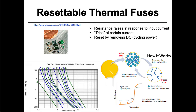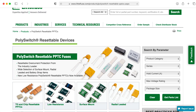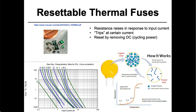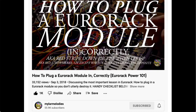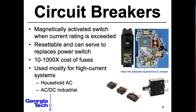A particularly wonderful kind of fuse is the positive temperature coefficient fuse, also called a poly fuse. The great thing about these is that once they trip, you don't have to replace them — remove the power and they reset themselves. These are popular for Eurorack synthesizer modules, especially because the Eurorack power connector is not polarized, so people tend to plug in their power backwards. Unfortunately, poly fuses are restricted to relatively low power systems, so they won't work for an entire building or heavy industrial equipment.